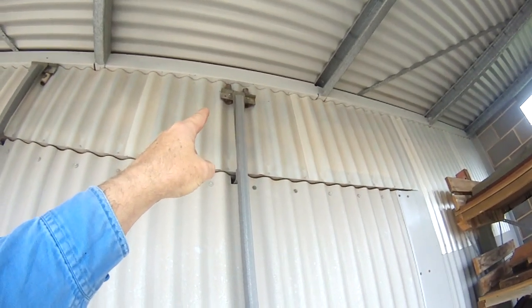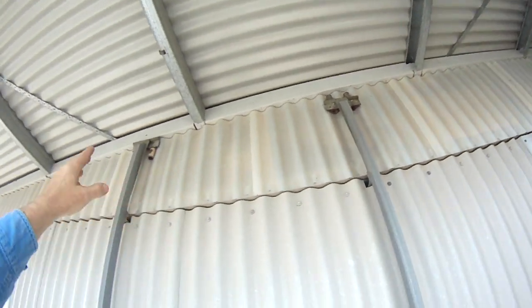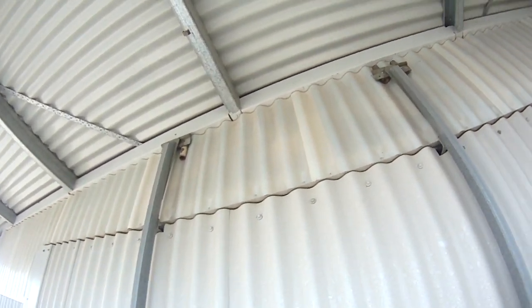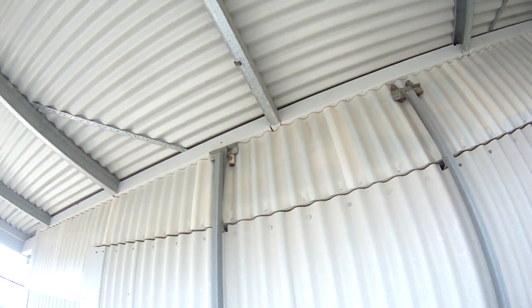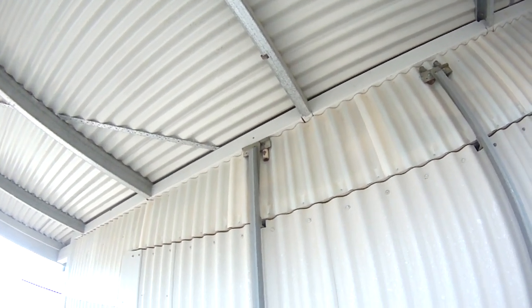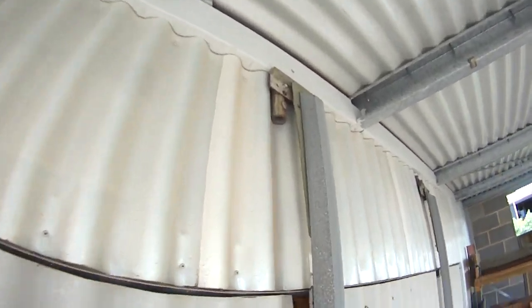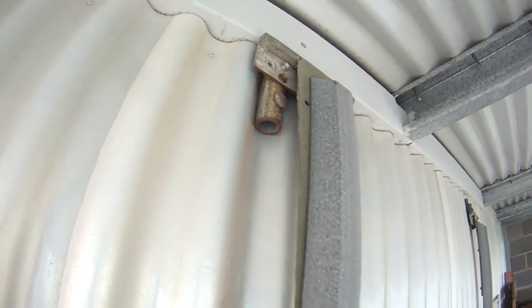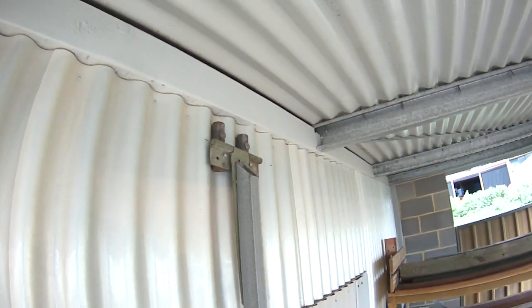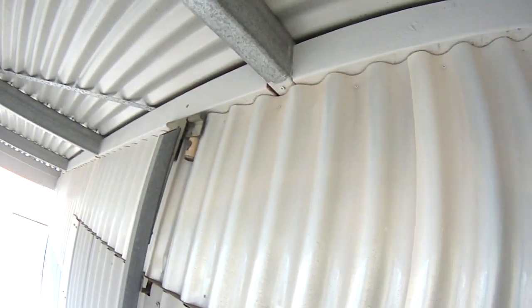You can see the pitch of the roof. I would have made these pivot points as high as possible, because that makes your door as strong as possible for wind loading and everything else. I only had this amount of space available. Because I have a steel beam on the inside, the structure of the door frame is 90 millimeters squared tubing — pretty heavy wall, because this is a high wind area and that was the design requirement for the shed. You can see a bolt there — that's to the middle of the beam on the inside that's holding the roof. The other bolt is above, still at the middle of the beam, but it drops the hinge to be level. They're both level with each other.